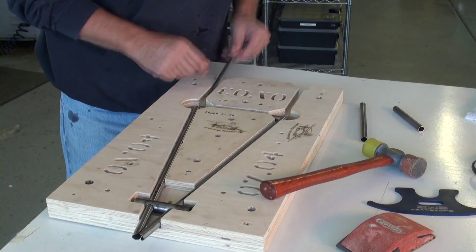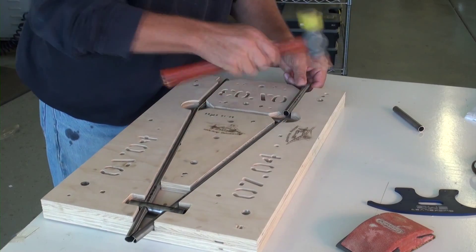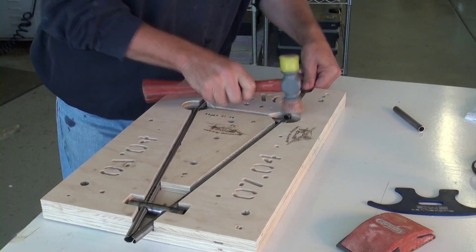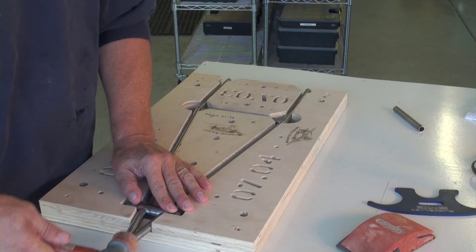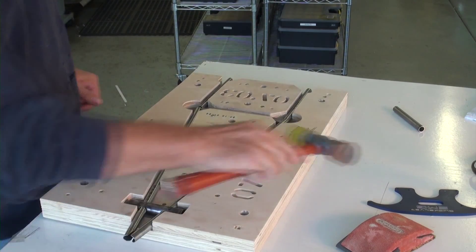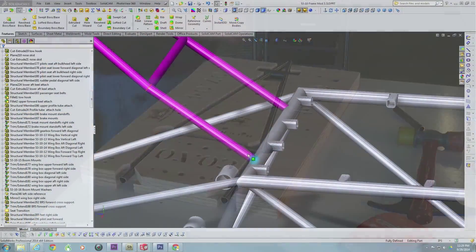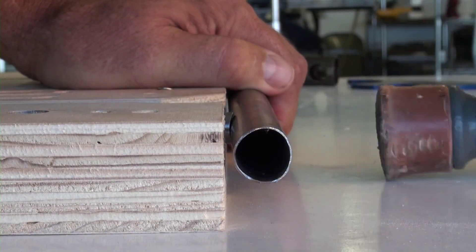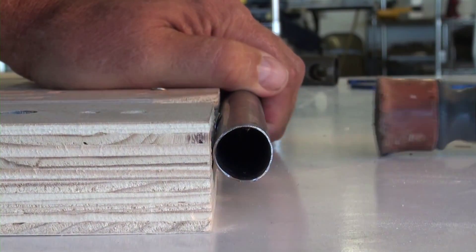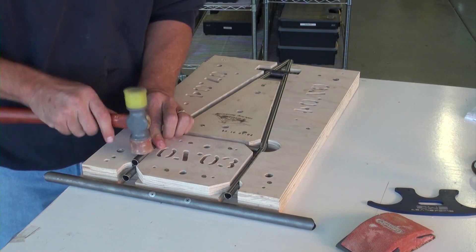Left and right — this one is for the right, goes this way, and this one goes this way. These are designed so that they fit up against another piece of three-quarter-inch tube that's part of the airframe, so this provides the reference for that. We'll simply tap these into place, and that leaves us just a little bit of room right in there. Double check to make sure that they're down all the way.